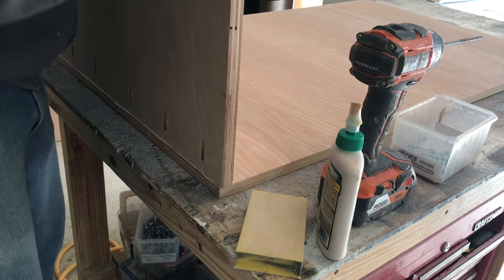I hope you enjoy. And there's the top. Like I said, it's just two ten-foot 1x8s. I cut them at five-foot lengths and used a quarter inch round over bit on the edges to get that rounded over edge so it wouldn't be so sharp. They look really good — it just gives it a little finished piece. You can actually use another piece of plywood up there, but I didn't want to spend another $50 for just the top, so I went with the 1x8s because they're a lot less expensive. It gives it a more finished look with the top on there. If you don't, you're going to see those pocket holes and countersunk holes where you put the dividers in. That's why I went ahead and put a top on it — I think it looks better and gives the piece a more finished look.